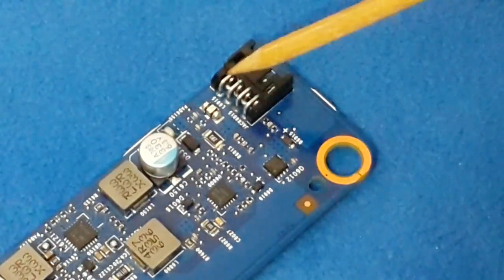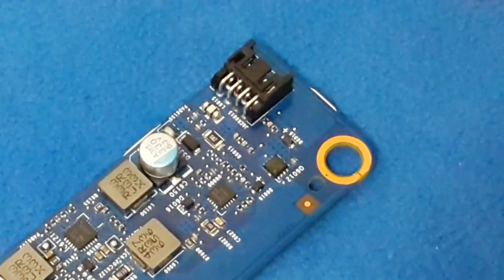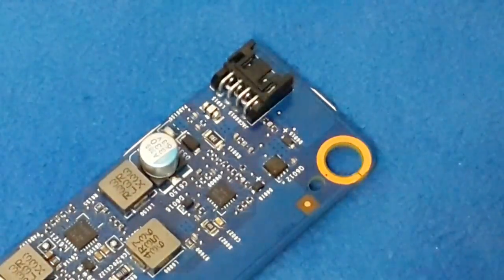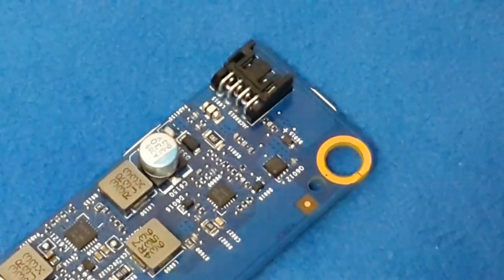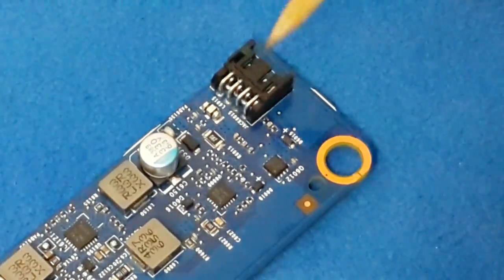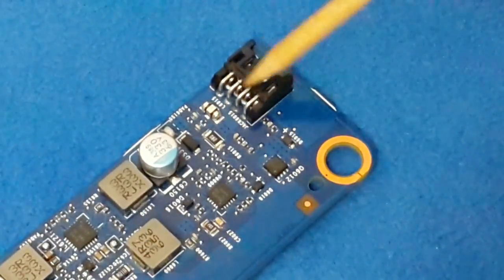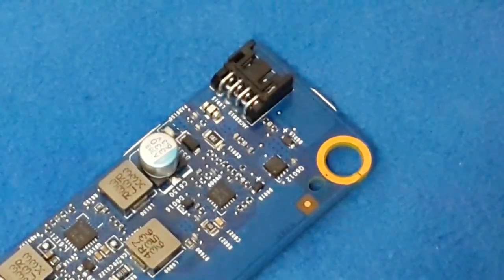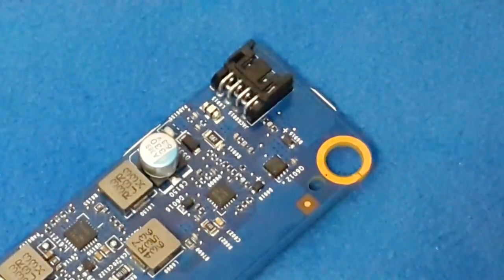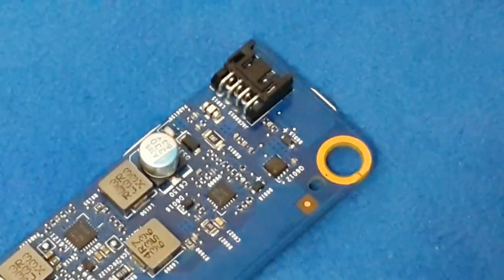In this case, we have to come here, connect the charger, plug it to the electricity, and try to find out what is the voltage. Remember, your laptop is different than this but the procedure is the same. I follow the connector and I have no voltage here — that means there is a short circuit in the main board, because the charger has voltage but it drops to zero when I connect it.